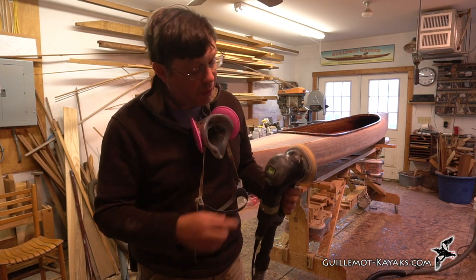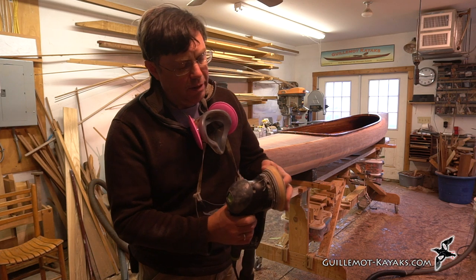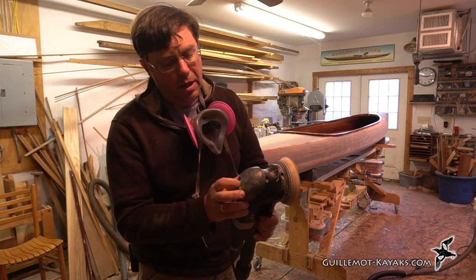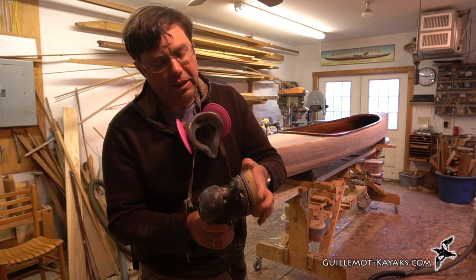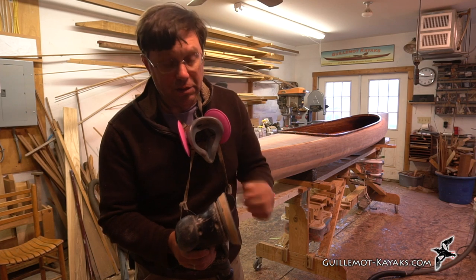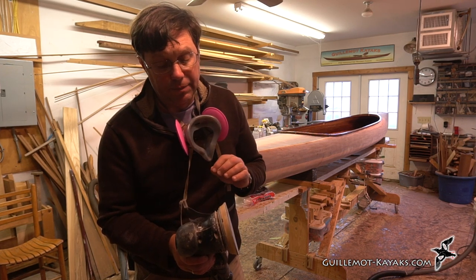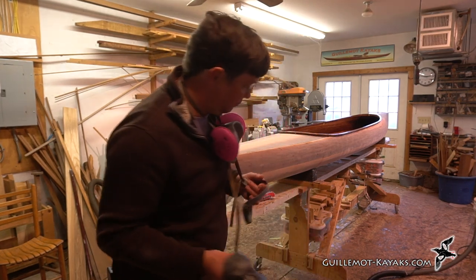I was in the aggressive mode, which is basically the coarser, all gear driven. In the finer mode, the sanding disc is a little bit able to freewheel, so it doesn't have as long strokes. It'll do a little bit of a finer job and work on creating smaller scratches. So have at it.